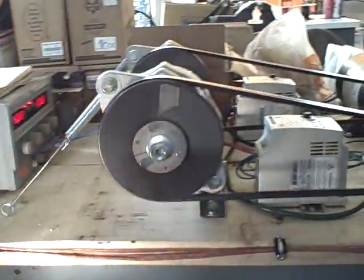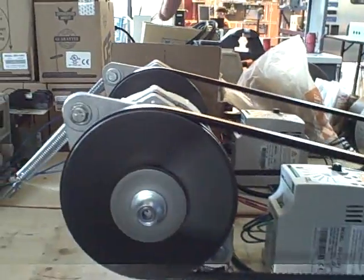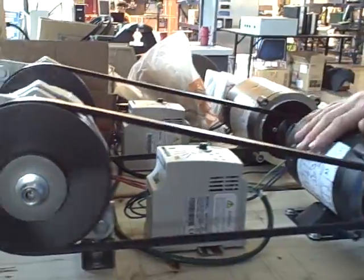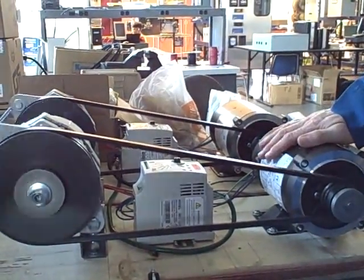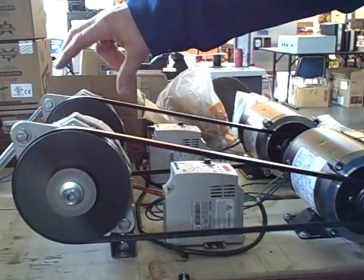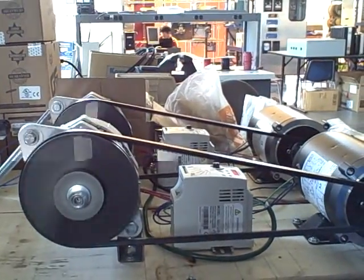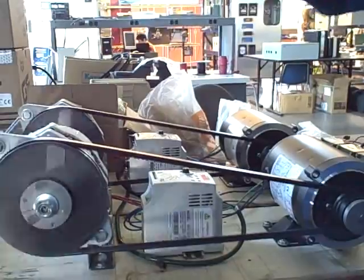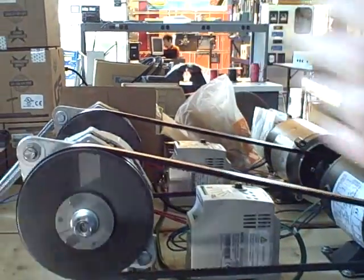We're going to do another demonstration of synchronizing two AC three-phase generators. We have these two three-phase generators hooked up on belt drives to a pair of AC induction motors, being powered by some VFDs. We have the ability to control the driving frequency of the VFDs to control how fast or slow they spin. We can take these two generators and electrically link them together through our circuit breaker network. Presently, both generator breakers are closed, so they're on the same grid, so to speak, and they are now electrically coupled together.